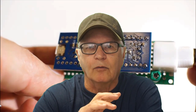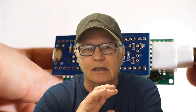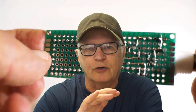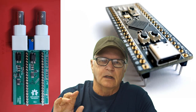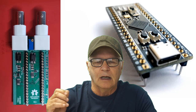When the HS101 Pro was first featured with its one megaohm impedance, five input ranges, and hardware-based AC coupling, the questions were: when can we expect an HS102, a two-channel pro version? Sadly, the answer was that an HS102 Pro was not in the cards. But here's the good news — it's the newly developed HS402, and it's got all those bells and whistles. It's based on the STM32 F411 board.